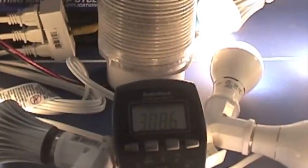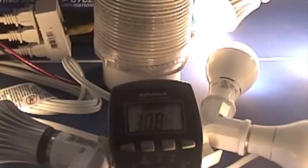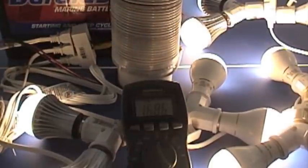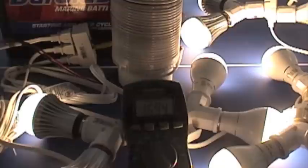We're back down to 3 amps — 36 watts to light the 12 bulbs on high. Going back to the medium setting, we're at about 1.7 amps for all those bulbs. So if you can get a solar panel that puts out 20 watts on average, you could run these bulbs all day long. If you run these half a day, you'd only need half as much power from solar panels. This is a nice, efficient way to light a small cottage or several rooms in a house. Thank you for watching.